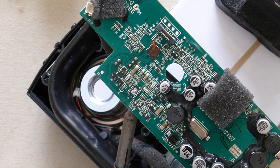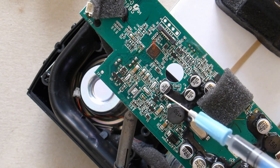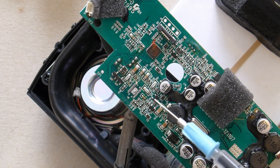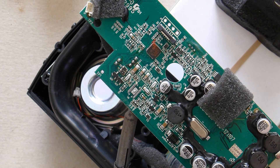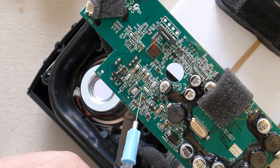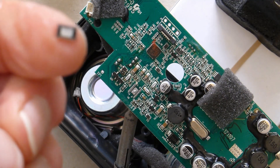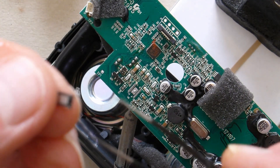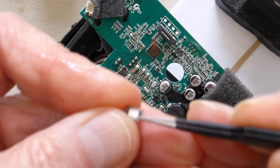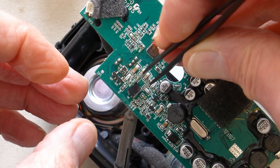I put a very small blob of solder paste right into the middle for the thermal pad — I try not to put too much on. It only needs about 50% adhesion to get good thermal transfer. I've just squirted a little bit of flux around the pads on the outside, and for the chip itself I'm coating the bottom with flux. The orientation is noted by just a tiny indentation on the pad, and that means it goes that way up — I really don't want to get this wrong.